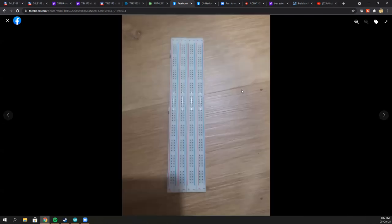This is how a bus could look like. A word of advice for anyone wanting to embark on this project: when you buy a breadboard, make sure you buy those where the power rail can be detached. I initially bought quite a few that cannot be detached and as a result could not configure the bus correctly, so I had to buy another set.